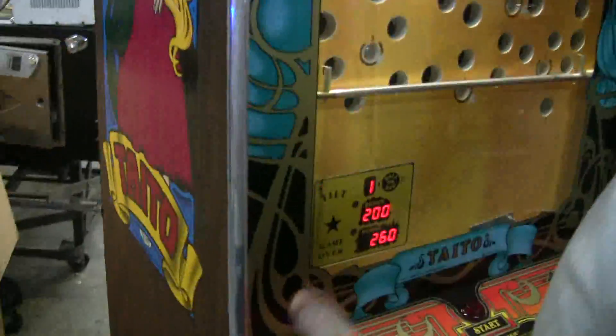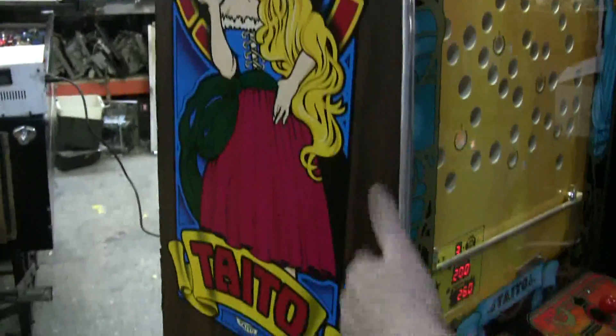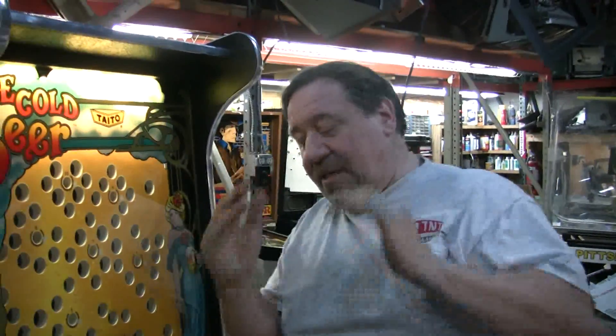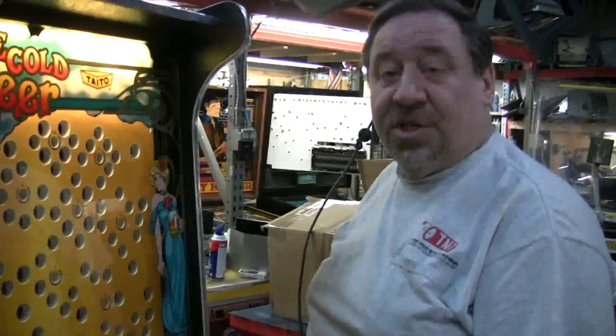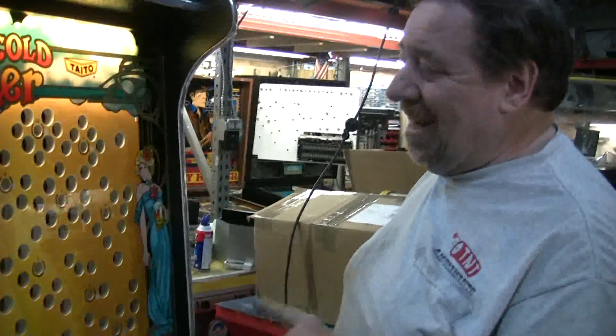You can hear the tilt sound — I just tilted it. Look at the sides of that, really nice. Steven only had to do a little bit of touch-up to this original decal and it just came out great. We have four brand new casters on the bottom. The game's pitch is very important — the game has to sit back just a hair so the ball leans against the wood. If it leans against the glass it's never going to roll back. Once the customer gets it to their house they can adjust the casters. They're easy to adjust with your fingers, you don't need a wrench or anything. You can get it absolutely perfect once it gets into the guy's house.